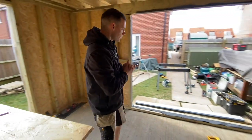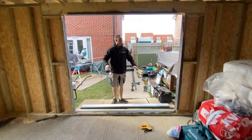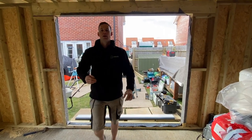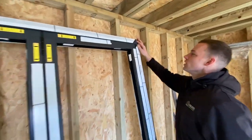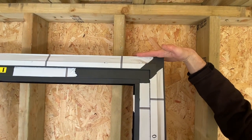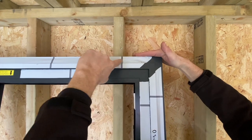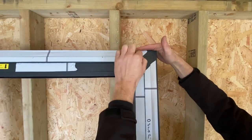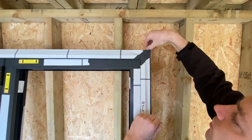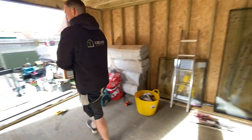Fixing these down is pretty straightforward. What we're going to do with this one is pack them up about 10mm, because we've got about a 10mm gap at the top for our plasterboard. They have a perimeter on them, and if you build them right up to the top of the aperture you're going to get a gap, and when you put your plasterboard it's going to close that gap. When you try to paint or put sealant there it becomes really difficult. So we leave 10mm above, and butt our plasterboard just up to the door line, which leaves about 30mm to access.